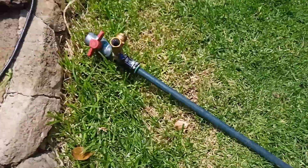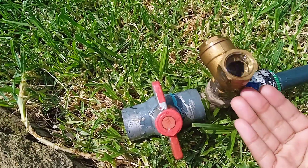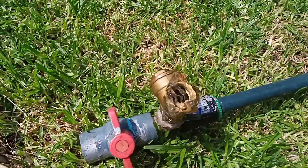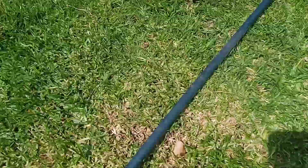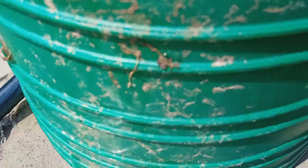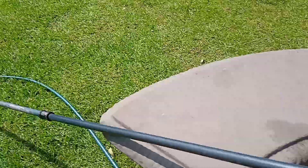What's happening is water is coming through the pipe. It's going up into here and it builds up enough momentum to slam the valve shut. When the valve slams shut, a shock wave travels all the way up to the tank. In the tank you can hear — you guys can hear that — like a heartbeat sound. That would be the tank.